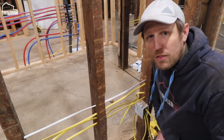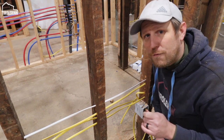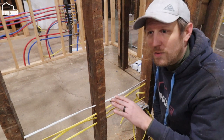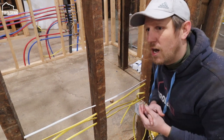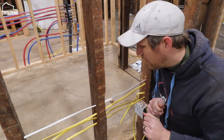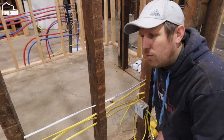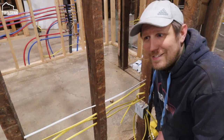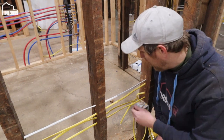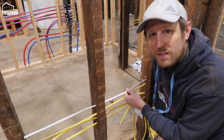If you're running a three-way or four-way lighting circuit, you will need a second hot wire to run from one switch to the other, so you can have continuous hot, and then obviously the two switches controlling when the light is on or not. And that is usually a red wire. So if you open a wall and you have red and black in the United States, that means it's probably a four-way or three-way configuration. If it's just a black and a white, then at that point it is just a standard.